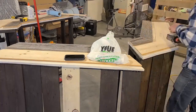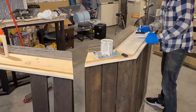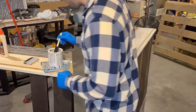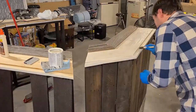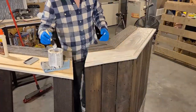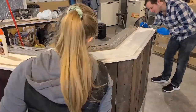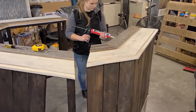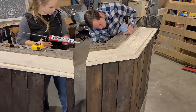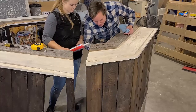While that was being worked on, I was tasked with making sure all the bottle caps were looking good and not completely bent. To do that I took a mallet and a piece of metal that roughly fit the shape of the bottle caps and hammered them into place, cleaning up the edges if they started to bend in weird directions. After the bump in the middle was cut to length, glued, and clamped for an entire night, we stained it and wiped up the drips. To make sure no epoxy would leak out the back of the barn board during the pour, we sealed it with a clear caulk.